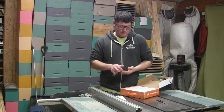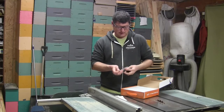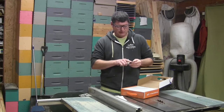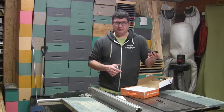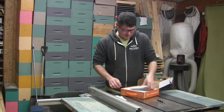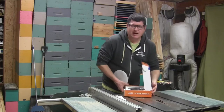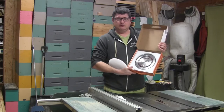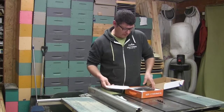The other complaint was that the bore diameter of the hole is actually slightly smaller than 5/8-inch, which is the common arbor size. Some people said the shims were super sharp — I don't find them too bad, but they are very thin pieces of metal, so if you're not careful you could cut yourself. As for the rest of the so-called storage case, it's basically just packing — a cardboard box with styrofoam. I wouldn't call it a case. I'll probably make something else to store it or put a hook on the wall.